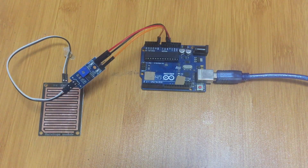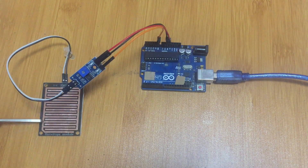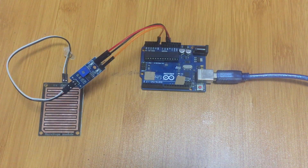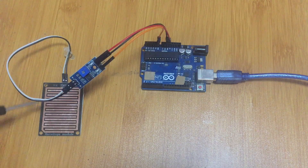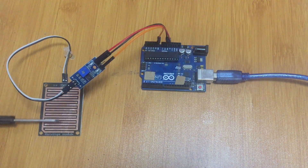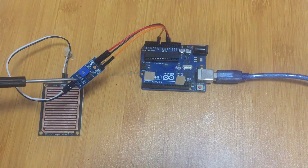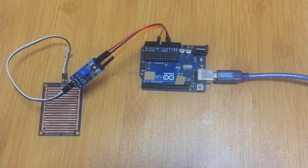This sensor is made up of two parts. It has a sensing pad with copper traces, which act as a variable resistor. That resistor has resistance which is inversely proportional to the amount of water that falls onto the sensing pad. The resistance is interpreted by a comparator. This other part also has a potentiometer for adjusting the sensitivity of the rain sensor, which also helps during calibration.